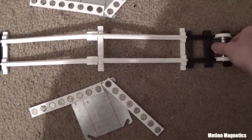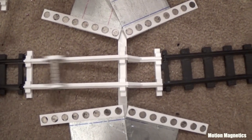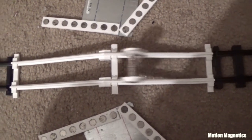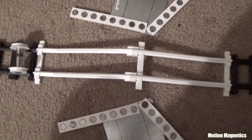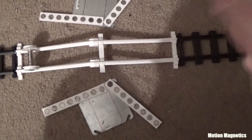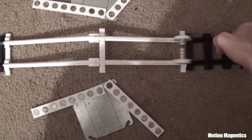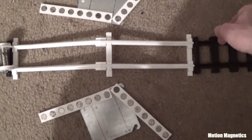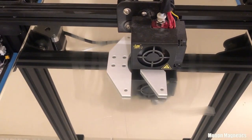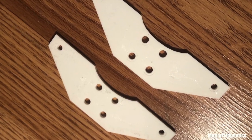This configuration would need to be tweaked because the magnets pass through the track but do not exit with any motive force — they are still being influenced by the magnetic fields. I noted that if the magnets had a bit more weight to build momentum, they might be able to pass completely through the flux. This gave me the idea of designing a new cart that would employ steel G-gauge train wheels, which would add some weight and potentially bring the magnets through the sticky spot or area of flux.